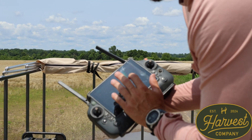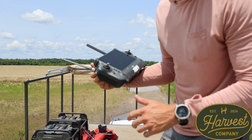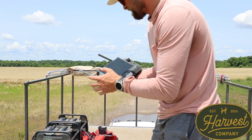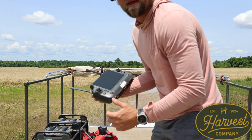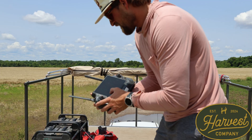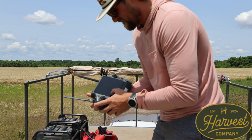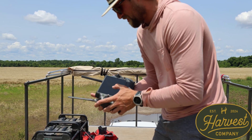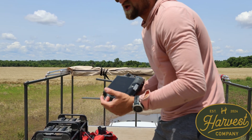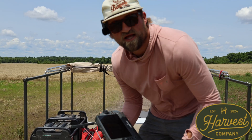Here's my field - I'll go through my settings. I have a template I use for just about everything and just make small adjustments. Running application rate of 2 gallons to the acre. Flight speed 32.8. Route spacing for a burndown I'm going to do about 20 feet - because I don't want streaks and I don't want complaints. Flying about 12 feet altitude, which will give me a good swath. Let's rock and roll.